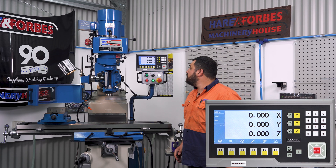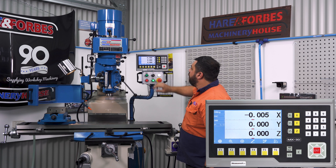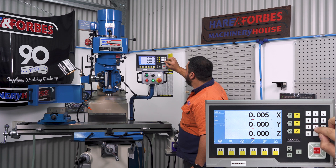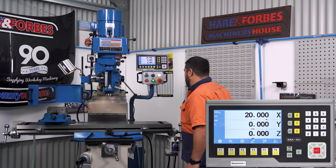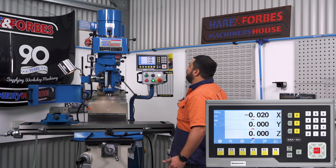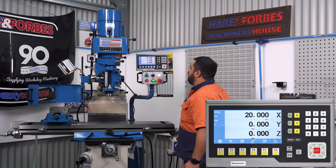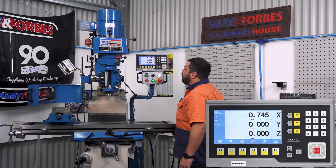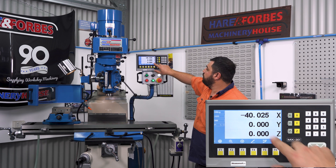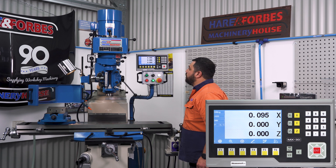A function I've not had on a DRO before is the distance to go function in incremental mode. This shows a little graphic representation of how much further you have to go. In absolute mode we've got our reference; set X to 20mm incrementally, and the little indicator offsets until it gets into the target — you're at your 20mm mark. Move another 20mm incrementally, set X to 20mm again, and it'll offset to the next position. If you then need to get back to your original reference, press absolute and it'll show that your original reference is 40mm away so you can return to it.